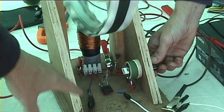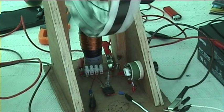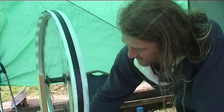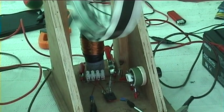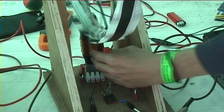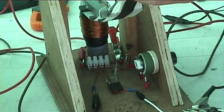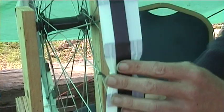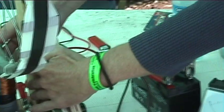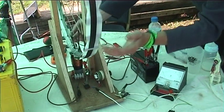Can you explain a bit about what's happening on the electronics or electric side? I can explain a bit — I've never heard a complete and thorough explanation so you'll have to forgive the gaps. I'll stop the motor a second and you'll see what's going on. Underneath the motor is a coil — two winds done together, wound around a coil several hundred times. Around the wheel we've got these magnets; they're all north poles facing outwards. What this running battery is doing is charging and discharging this coil, which is pushing each magnet past. So that's the triggering for the motor — that keeps the motor running.